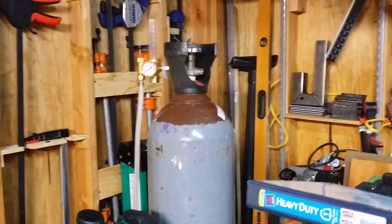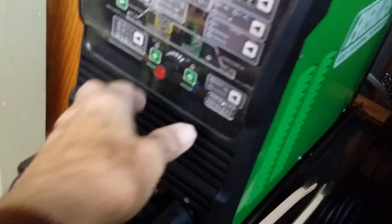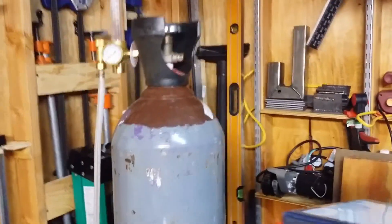The first thing I thought of was: do I have argon on? Yeah — I was running about 20 CFH on it, which is efficient. I did the test with the pedal, pushed the button. So argon wasn't the issue.